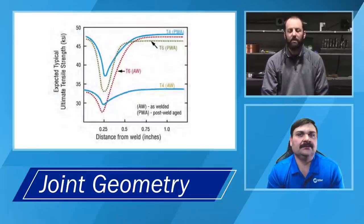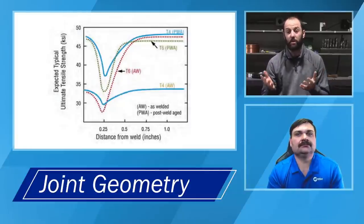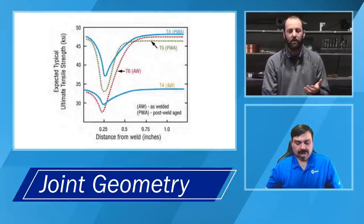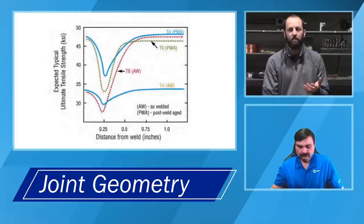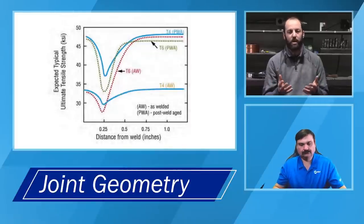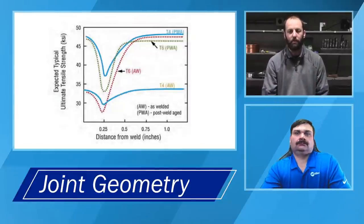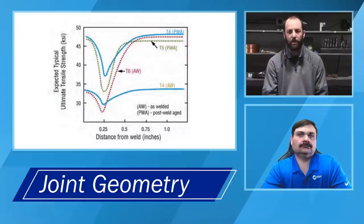Yeah, so generally those abrasive wheels, whether it's for a steel-based abrasive versus an aluminum-based abrasive, one of the big differences is going to be the material that it's made out of. A lot of times, if you use an abrasive wheel that's designed for steel and you use it on aluminum, what happens is it loads up and then you just get frustrated with it because it's no longer cutting. It's completely galled or filled with that aluminum-based material.